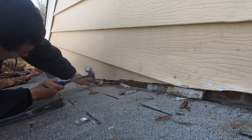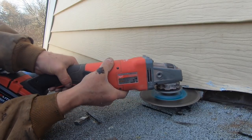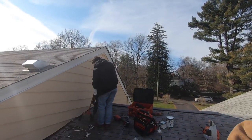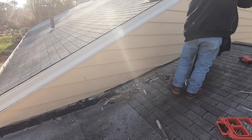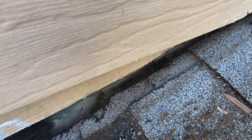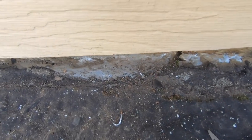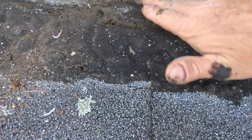You want to see the copper flashing? No more dirt. The siding is a problem — in this case it's aluminum siding — it causes problems when it meets up with another roof. It's too low, and the old wood siding was too low, so debris collects there. They couldn't do a proper attachment with the flat roof here. They put tar but they couldn't get to it, and they never got the roof right there to the corner.